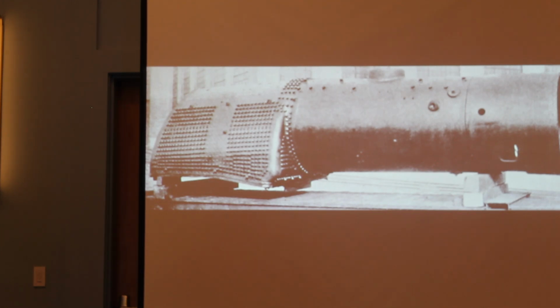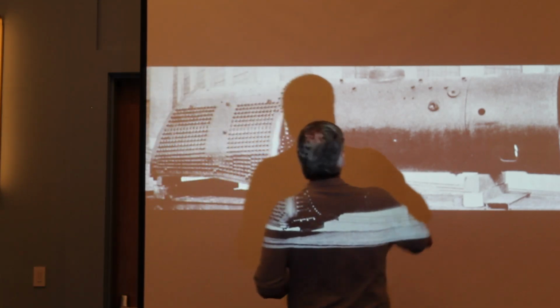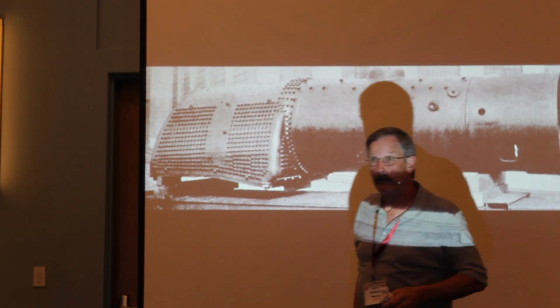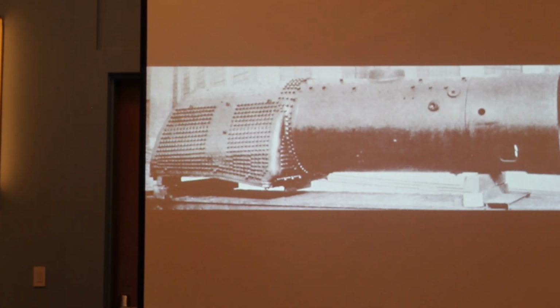And so the steam dome is welded too, it looks like, and you put it there at that time? Yes, because this would have been very good. Up here, there still would have been a flange that was riveted to the barrel. That went away as well. They cut a hole in the boiler course, and there'd still be a flange on it, but the flange would come down and butt all the way around on the shell itself, and they weld that full penetration.